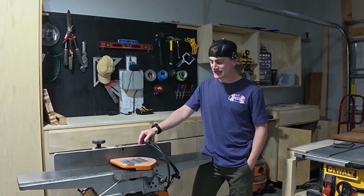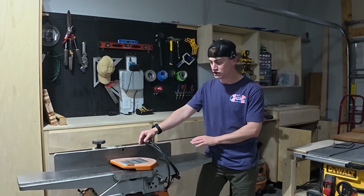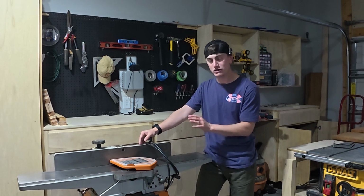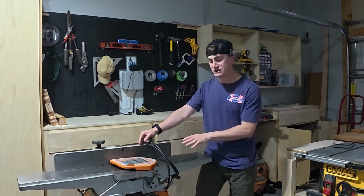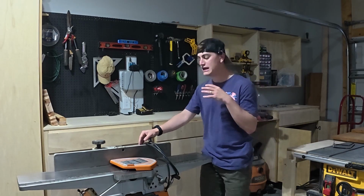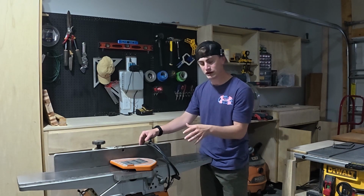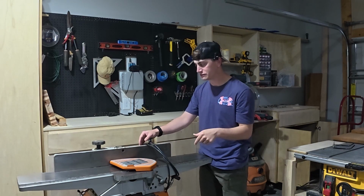So a quick recap, what we did is we went ahead and we took care of the surface of our cast iron jointer, not exclusive to the RIGID JP06101. This would work for any cast iron surface tool, and then we put paste wax on it to protect it from the elements, from future surface rust, things like that. The next thing we did is we changed out the straight blades in this jointer. Again, not exclusive to this jointer, would work for any straight blade jointer with the assistance from the Jointer Pal. Affiliate link will be in the description.